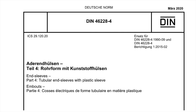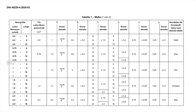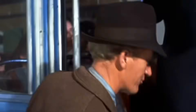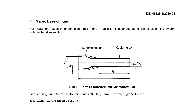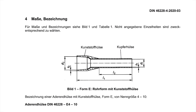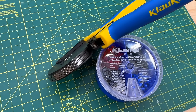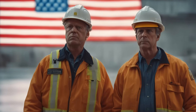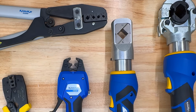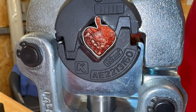When it comes to standards, the most commonly used standard for ferrules is DIN 46228 part 4. There is a catch — it's only published in German. This standard covers dimensional tolerances, pull strength tests, and material performance, so it's a good idea to ensure that any ferrules you buy meet these requirements. We recommend using ferrules and crimping tools from the same manufacturer for best results. If you're working on equipment intended for the USA, you may need to comply with UL 486F, which requires ferrules and crimping tools to be approved together as a system. Many industries also have their own standards requiring matched tooling, so it's worth checking before you buy.